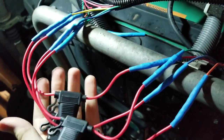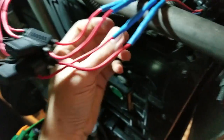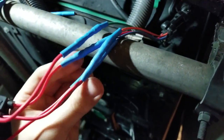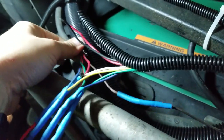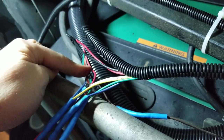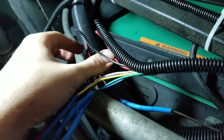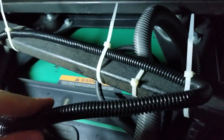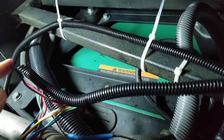These are some 5-amp inline fuses that I bought and put on because that's what the Xantrex manual suggested. Over here, these wires and this split tube go to the panel that the motorhome manufacturer installed. And this group of wires comes from that conduit I ran all the way back to my inverter and AGS module.